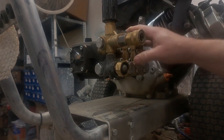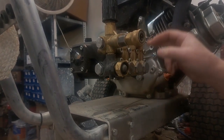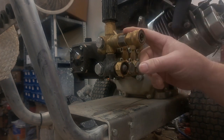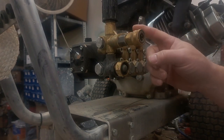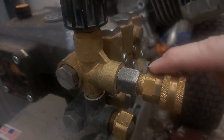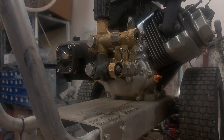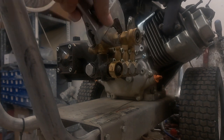As I mentioned, he's got water going in but no water coming out, even with the engine and pump running — nothing at all. Usually most pumps are a free-flow situation, so water flows through as you're using it or when you're not, as long as the water pressure is on. I checked it out and sure enough nothing's coming out of the high-pressure side with or without pressure. We're going to remove this — there are two fittings: a quick-connect and a collar. We're taking the collar off. Nine times out of ten this is where your problem is — basically a clog.